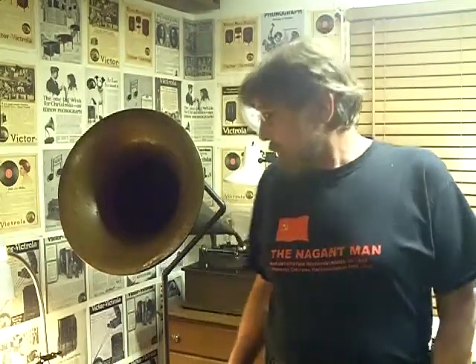I have to say that I'm quite proud of the fact that I developed this process. When I began this project, it was with the intention of becoming extremely proficient at recording on an Edison cylinder phonograph. It has been a very long and arduous journey. I have spent months in this little room doing recording after recording. I have made literally thousands of recordings on hundreds of cylinders, and it is really rewarding and gratifying to be able to take an audio file from an unknown source — in this case captured off a YouTube video — and using the Canaphonic process transfer it to an Edison black wax cylinder, which in this case is a shaved and trimmed dictation cylinder from 1929.